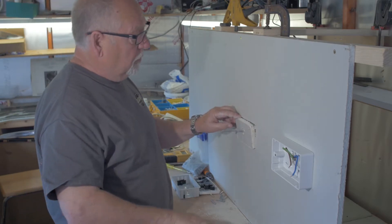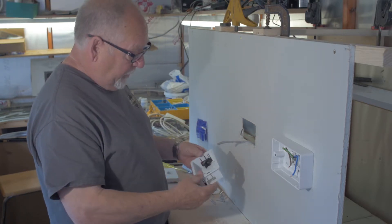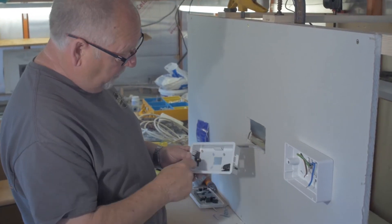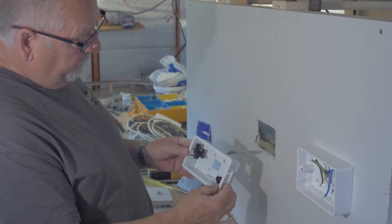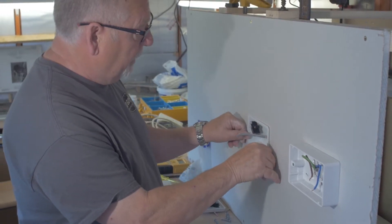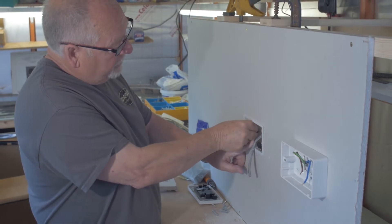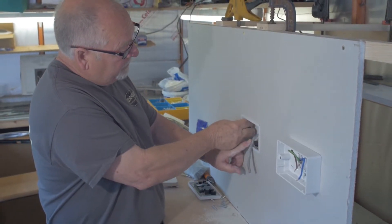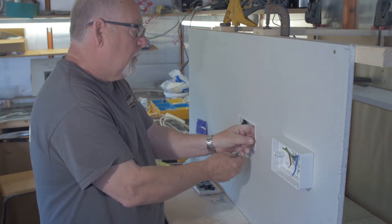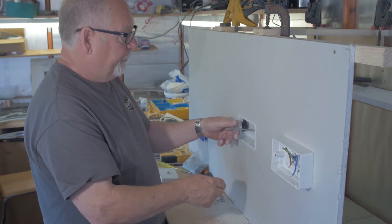Cut and remove the saw, and the section of plasterboard will come away — discard that. Now comes installing the box. As you can see, the support clips are on either side, so you need to close them in. Feed the cable through the middle of the hole and gently push the box home. The support clips go back in and slide towards you — same on the other side — and that's the box in.